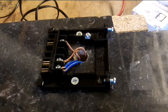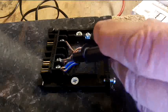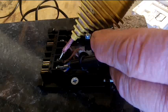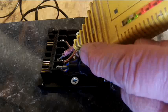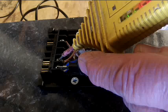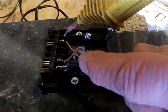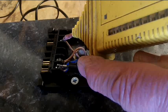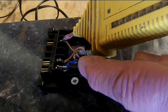Once we look inside, we can see that's the neutral, and that's the live wire, indicated by those little lights on there. In its normal state, that's the live wire going out — that will not be live because there's no juice there because the switch isn't thrown.